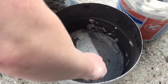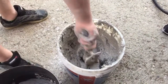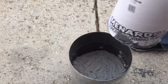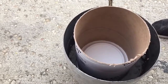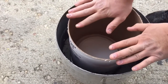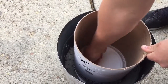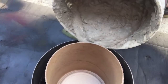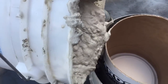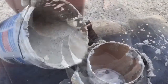I'll take my trowel and smear the thick mix around the bottom of the tank, making sure it's kind of flat. Then I'm going to add more water to my mixture to make it thinner. I can take my form made out of the concrete forming tube and put it right in the middle of my tank, resting on the filler material, pressing the bottom all the way down. Once it's centered, I take my thinner mix and pour it around between the tank and the form, going around a couple times filling it in. You might have to readjust the form a little bit here and there.